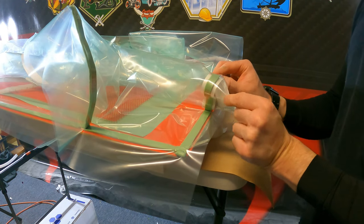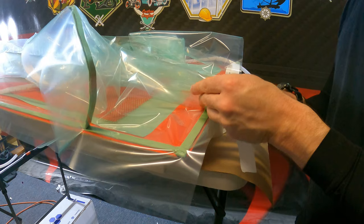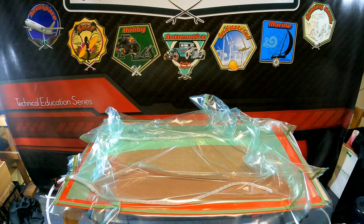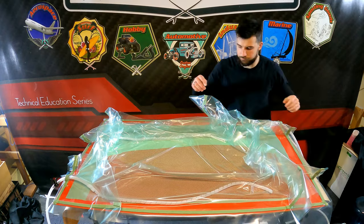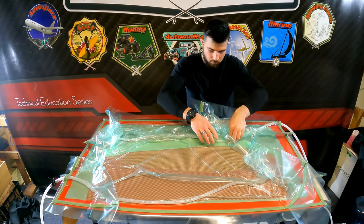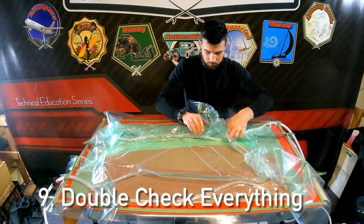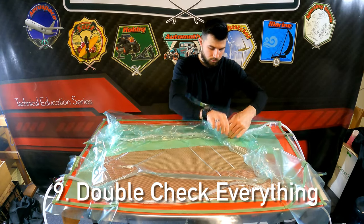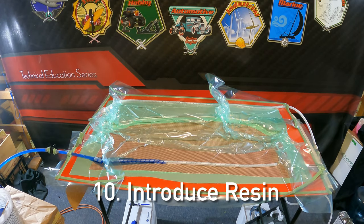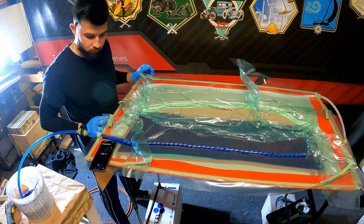One of the things you do to get the bag to perform properly is put pleats in it. The pleats give you extra bag to push down into the corners. This particular mold is pretty flat so it doesn't need a lot of pleating, but for molds with a lot of shape you don't want to stretch the bag — it will relax back out when you put resin in. Pleat it and have extra bag to get down into those corners. He's pulling his initial vacuum, then letting a little air in to release pressure so he can move the vacuum outline. You do want the vacuum outline on the peel ply, but as far away from the cavity of the mold as possible. He's adjusted his resin feed line and checked his vacuum level.